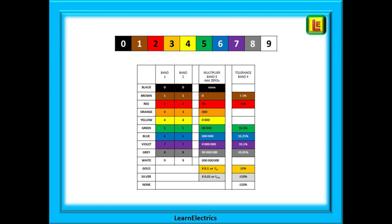Learn the resistor colour code and, to those that don't know it, it will seem like you are the master of a black art. Also, those colours that represent the numbers 0 to 9 are standard throughout industry — not just for resistor values, but also used in numerical control circuits and robotics cabinets to identify cable numbers. This is powerful knowledge. Have fun.